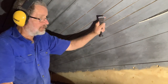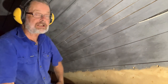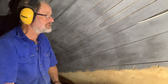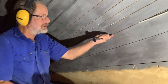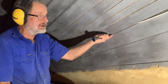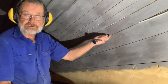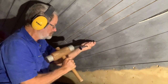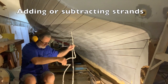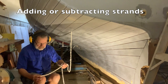The noise does vary by whatever backing you have — ribs, floors, keel, whatever structure is there. It sounds more hollow in areas that aren't closely backed up. If it still feels dull and is driving in, you've either got to rip it out and try again, or just add more if it's not going through. Seams aren't always the same width all the way along — particularly when re-caulking older boats — so you often need to add or subtract strands. Simply unspin the bit you have left, add the new strand, and spin it all together; or if reducing, tear off a strand and re-spin it.